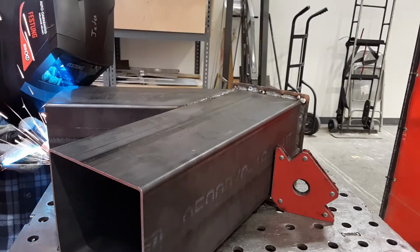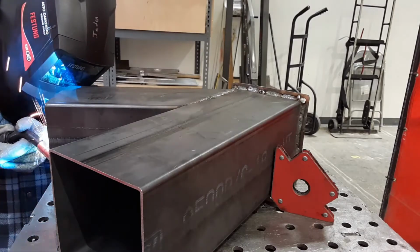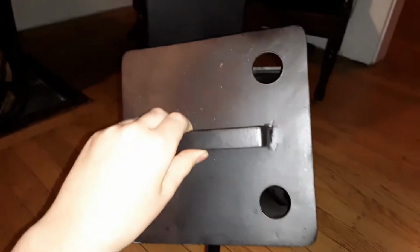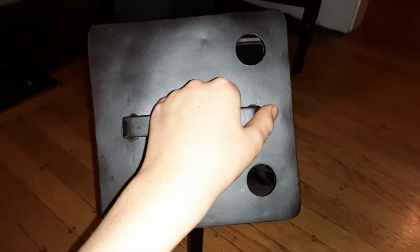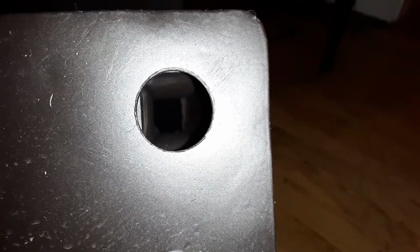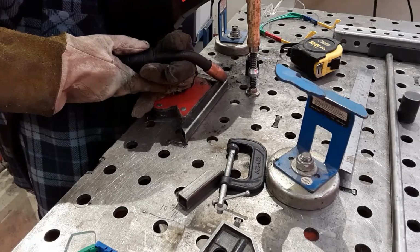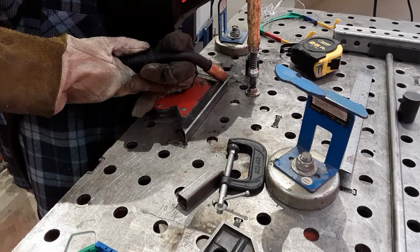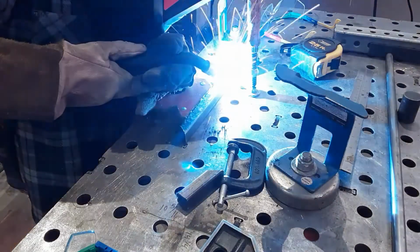With the basics of the rocket stove figured out, I began designing the smaller things, such as the handle. For the door, I found a steel cover with a handle that fit right over the firebox. I then drilled 2 holes for the hinge and 2 holes for the air intake. For the handle, I used a 10-inch piece of 3/4-inch square tubing that I cut into 2 2-inch pieces at a 45-degree angle and a 6-inch piece for the top.